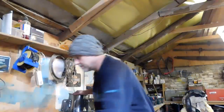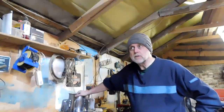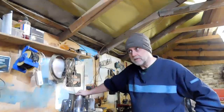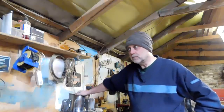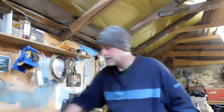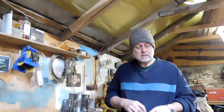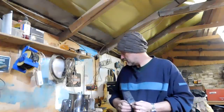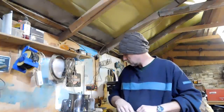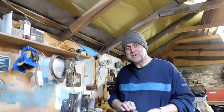So I've now sanded this with 320, 400, 600, 800, 1000, 1200, 1500, 1800, 2000, 2500 grits wet sanded, 3000 grits from my last one. I can safely say I'm tired. It's taken quite a few hours, but looks reasonable. Certainly as shiny as it's going to get for the time being.